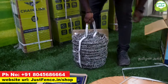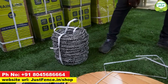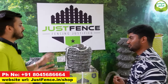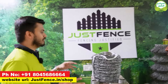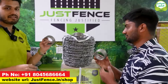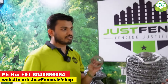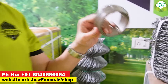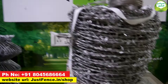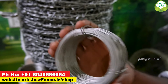The second benefit is when you are doing fencing installation, how do you bind the fencing? You have a great quality product but if you are using normal binding wire with waste quality, it defeats the purpose. So we provide SS304 grade stainless steel binding wire — 304 quality — complimentary, free of charge, with the product. This prevents rusting in the binding area.